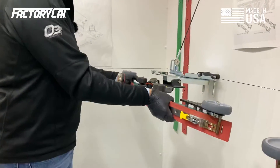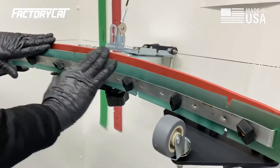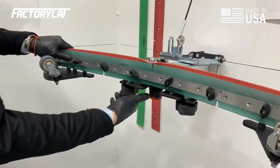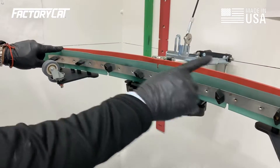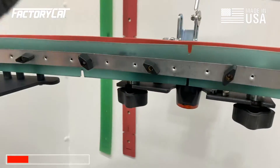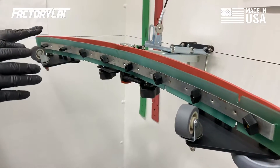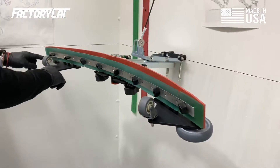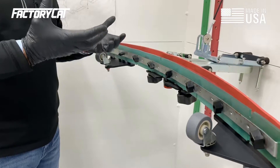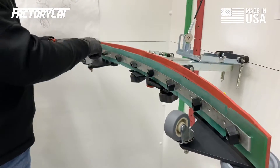Another thing you probably don't know about your squeegee — if we flip this upside down, I can show you. On the inside edge, which isn't that critical for water pickup, it's just holding air and creating velocity. It's really your back squeegee blade that provides superior pickup. But if you notice, there's three holes on this side and five holes on the top side. This allows you to flip your blade to change airflow performance on different types of floor. If you're on a very smooth floor like polished concrete or VCT, there are no natural air leaks in that floor, so you want to create air leaks in the blade. If you're on a really rough, busted-up concrete or grouted tile, which already has natural air leaks in the floor, then you don't want as many air leaks in the blade, so we're going to run the three-hole side down.